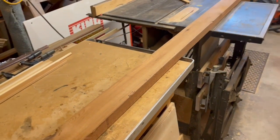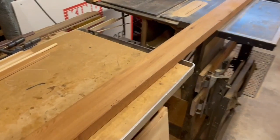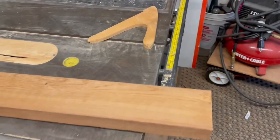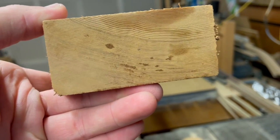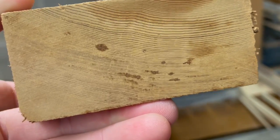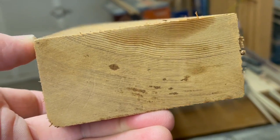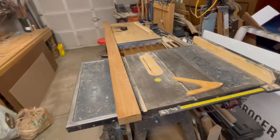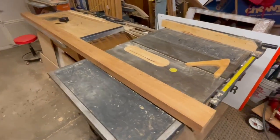Any cross grain is going to behave the same in an arrow as it would in a bow — it'll just break. I purchased this piece of lumber for $16 at Home Depot, so we've got $16 invested in this project. You also have to make sure you get a board with really tight growth rings. These growth rings are so tight as to almost be imperceptible, and that's what lends a softwood like cedar or juniper its strength. Without very tight-grained wood you're just dealing with weak material.